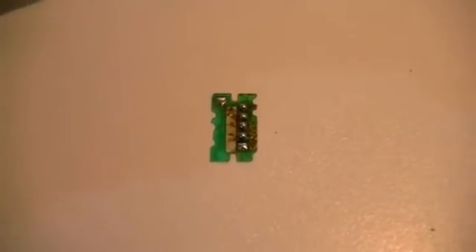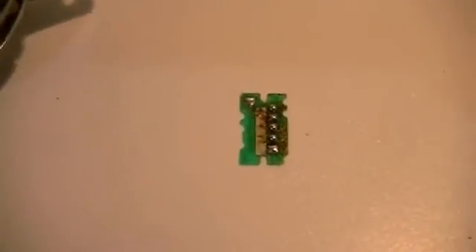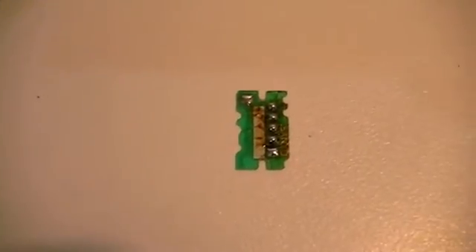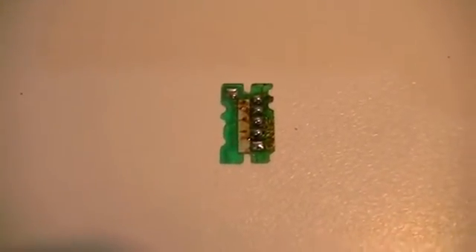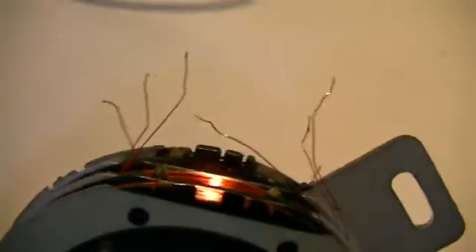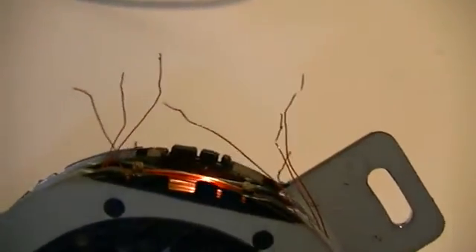The first part of this operation with our new stepper motor is we have to separate all the coils because they were all interconnected in some form or another. As you can see here, we have 8 wires altogether, which means we have 4 coils — 2 on one side, 2 on the other. So this makes our job a little easier. What we are going to do first is determine which wires are for which coils.